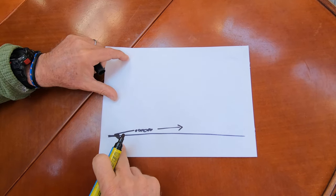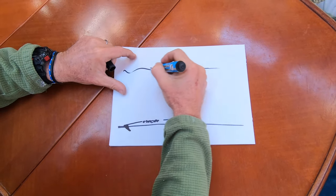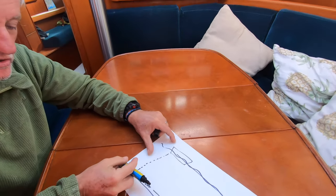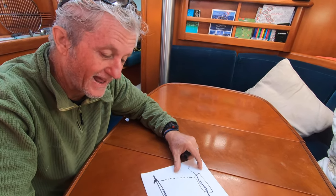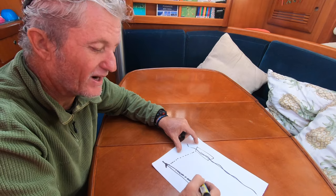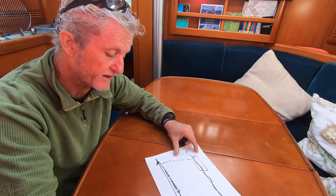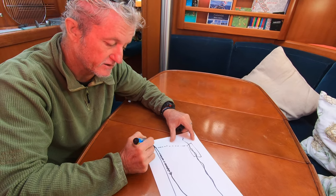When it's time to lift your anchor, you would sail your boat to the point where the angle is more perpendicular. That turns the anchor and you can quite easily pull it up. So the more lateral force you have on the anchor, the better it performs. We've got 80 meters of chain, and the weight of the chain plays a role — it keeps that angle more lateral. The weight is important, but it's not the all-important thing. It's actually the design and the anchor's ability to dig into the sand.